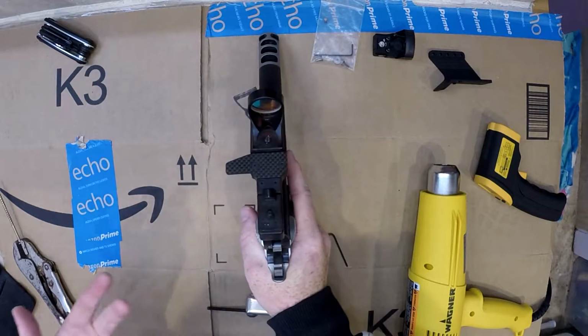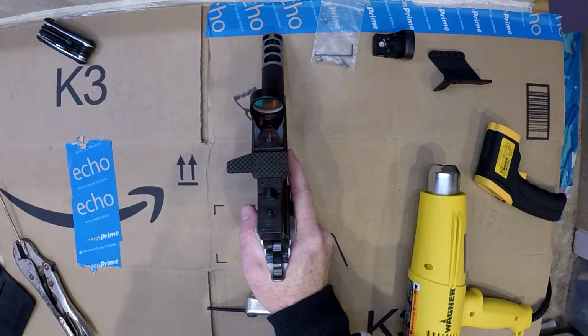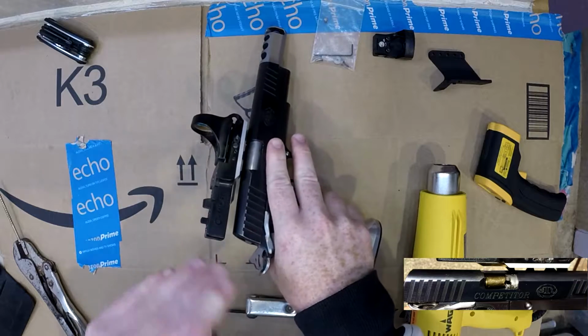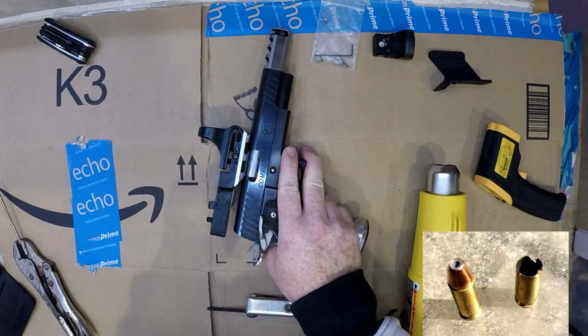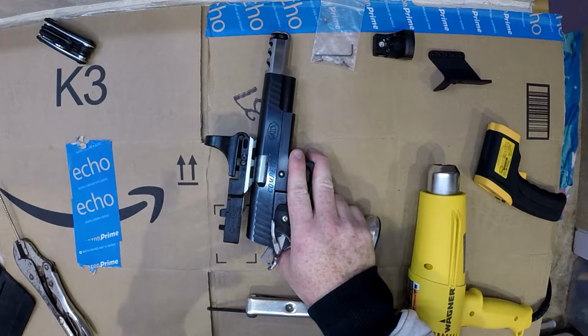My gun worked pretty well for a while, but I started to get consistent problems. I would get stovepipes, cases mashed up against the barrel hood, between the barrel hood and the breech face, and the brass would be all messed up. But the problems didn't pop up consistently enough for me to be able to diagnose what was going on.